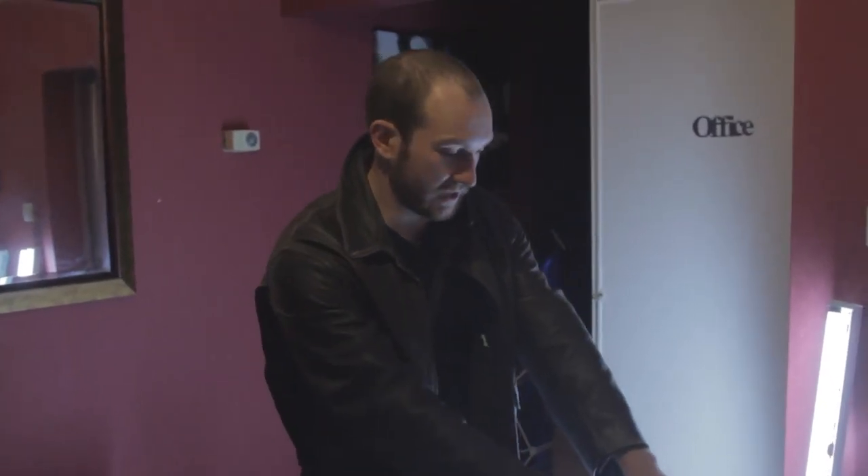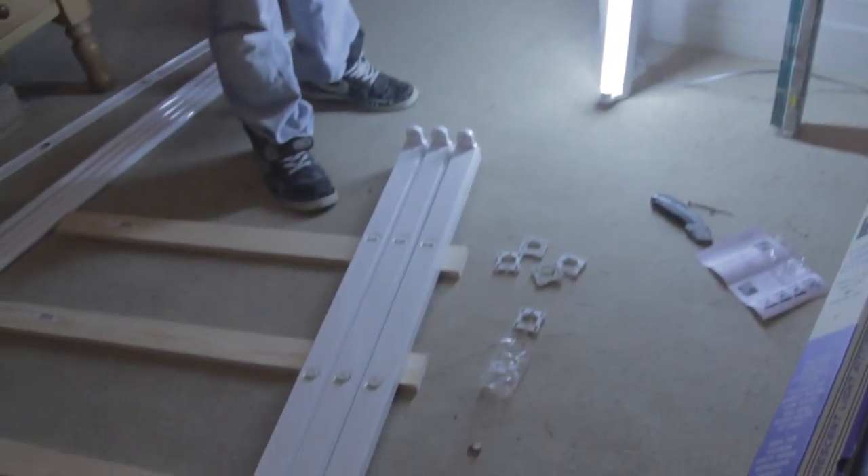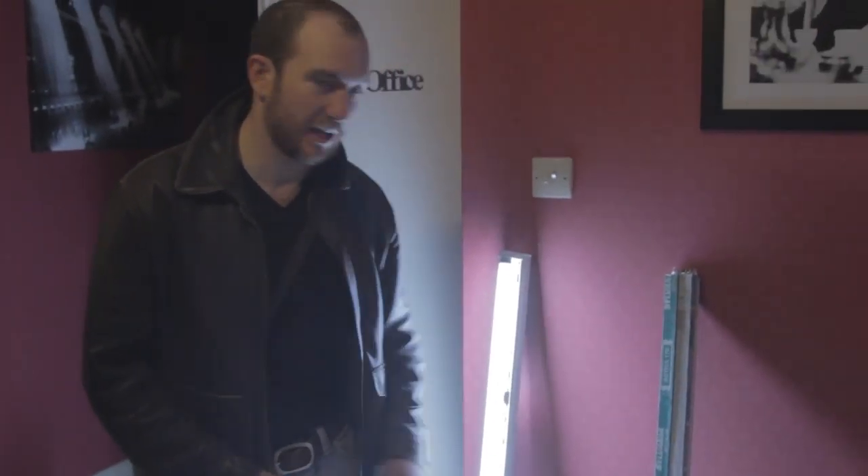We've got our four fluorescent lighting fitments back. We've got three of them here, we've got one of them set up. We've just been down to the lighting store and picked up these. These are much higher CRI, which stands for Colour Rendering Index, which is basically talking about how accurate that white light is. Now, that's separate to colour temperature as well — they're two different things. Colour temperature is effectively your red versus your blue, and your CRI is more or less how much green works its way in there as well. It should be balanced, but sometimes it's too much green or too little green.